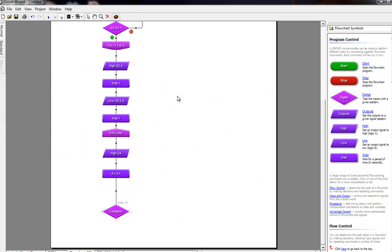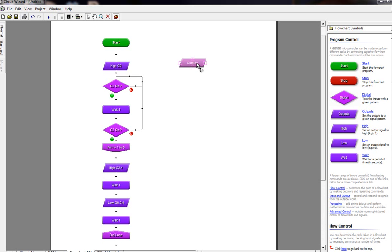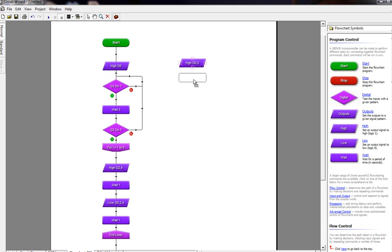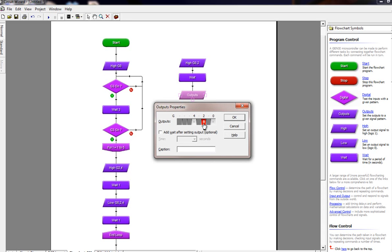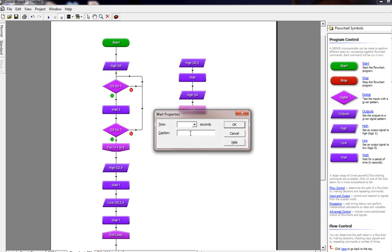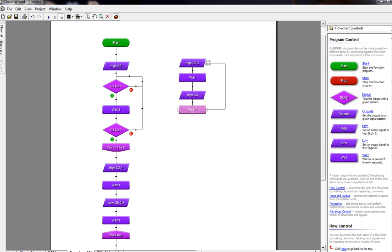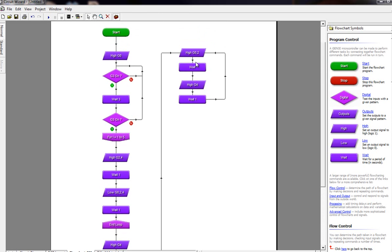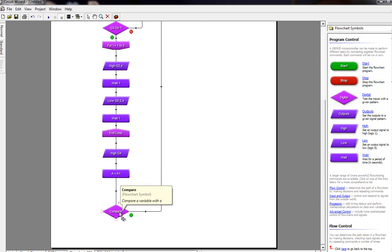To set the alarm off, I'll turn on output zero, and also turn on output two at the same time, wait a second, then turn off output two and turn on output four, wait a second, and basically keep looping around like that for as long as it takes. If the light level hasn't gone up and no one's trying to steal anything, we just feed it straight back into the compare — has someone stolen from us yet? No. What about now? And so on.